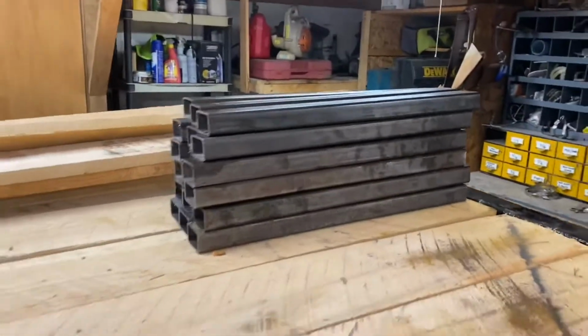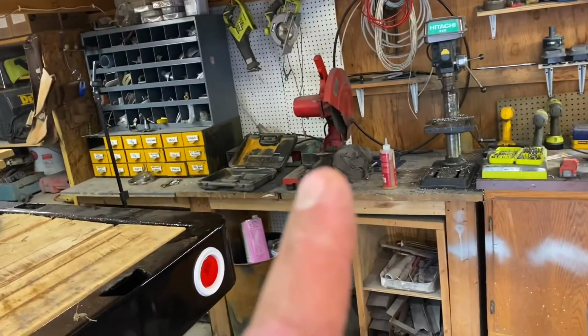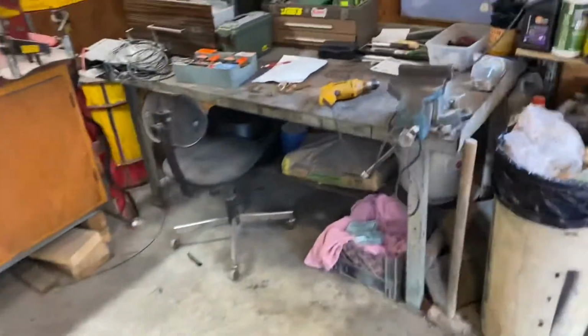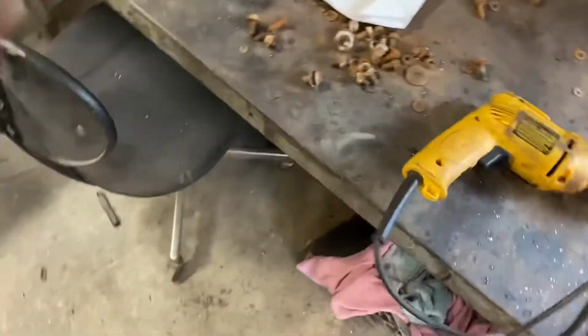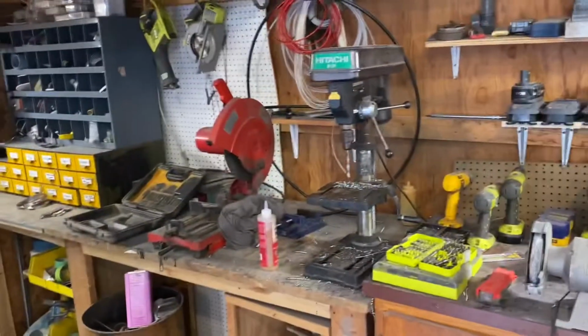These ones are a lot nicer. Still got to be prepped, but you saw me maybe in that time lapse struggle with the drill press a little bit. Just the set screws on the pulley going down to the shaft were loose, so once we got that straightened out, that was way faster. I did 3 with the corded drill and the vise. I would have been drilling for days, well, not days, but it would have taken a long time. And those ones are not nearly as straight as the ones in the drill press. So at any rate, it's done.